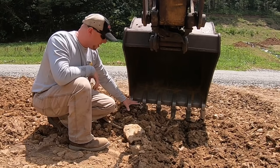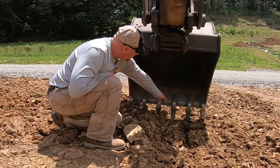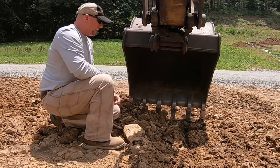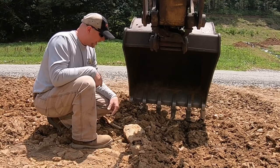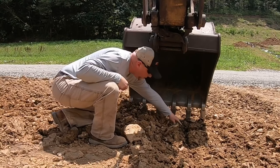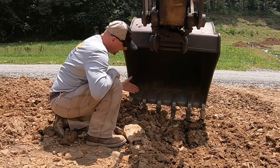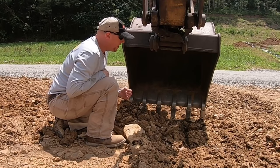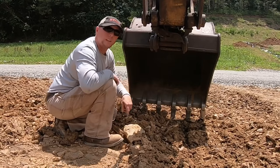And what I'm looking at is not what I've got to collect. All I'm watching is I'm trying to make these teeth line up at the bottom of these teeth trenches that I've already done. And even more importantly, another way to look at it, to use in your mind to make this easy, is you want this bucket to dig in to where you can just barely see daylight between the previously graded ground and the edge of that cutting edge. And you just follow that plane and you just keep moving over, and you will start cutting that grade as far as, like, from the road to you, you're starting to cut it down. Check this out.